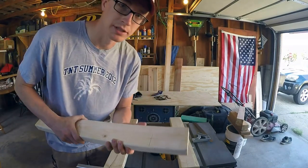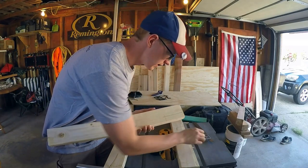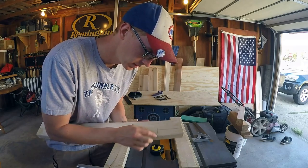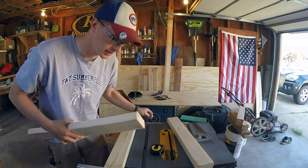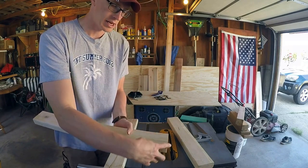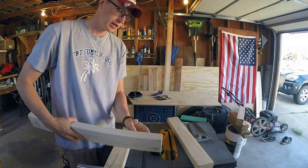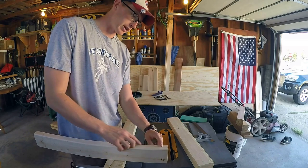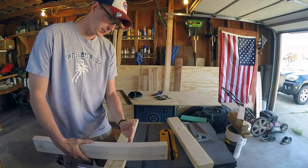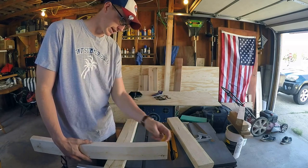The depth of this cut right here is going to be an inch and a quarter — that's how wide or deep these are. I'm going to cut this part off, going about four and a half inches back into the wood, and that'll give me enough space to put at least two screws in the plywood right here. I'm not going to put a cross brace at all in between here because the plywood will be fine for that.